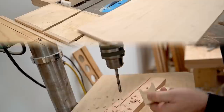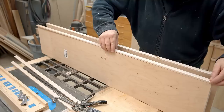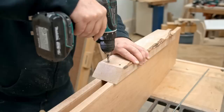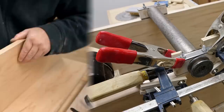Next I can work on the frame, and that's two long rails made from three-quarter inch plywood. I'm also going to cut some solid maple to cap the top and bottom of each rail. The glue I'm using is polyurethane construction adhesive — get that spread on, get the wood in place, and drive in a few pins. Then I'm drilling the holes for the threaded rods that will hold the bearing blocks in place on the tops of these rails, and once again using polyurethane construction adhesive to glue the rods in.